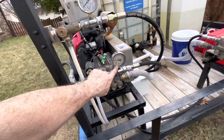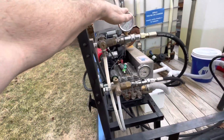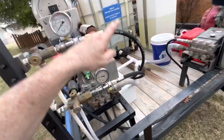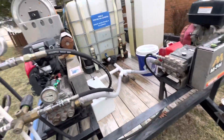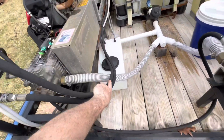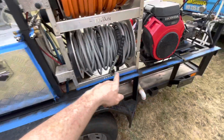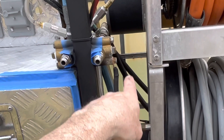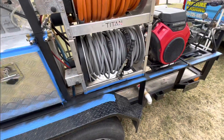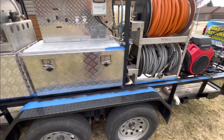I have my gauges — this one appears to be malfunctioning. This one goes to the 8 and this one goes to the 5, which runs right down through here. Someone is going to ask what happens after the unloaders. You see these two hoses run nice and tight right along through here, and they fish themselves right under there and up through here — do you see it? And then right through here. So when I get to my stop, all I have to do is unreel the hose that I need, pop it right in here, start the machine, and I am ready to go.